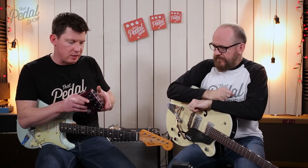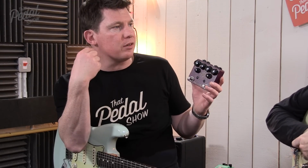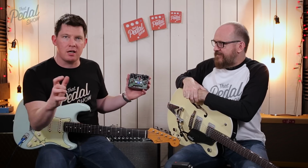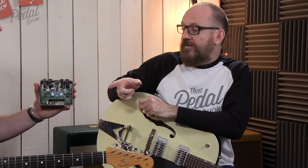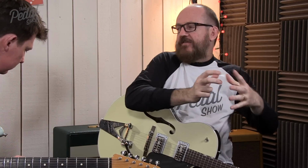So we're not going to muck about with the dip switches today. We're going to set the King of Tone as it comes, factory standard: the red side, which is this side, is overdrive, and the yellow side is clean boost. You can set either side to either configuration, but Analog Man says it's better to have a bit of overdrive to begin with and then be able to boost it afterwards. Factory standard is also to have the treble control at zero. The other thing to mention is we're stacking our gain circuits, and it's a really big part of this sound, having the two gain circuits cascading into each other.